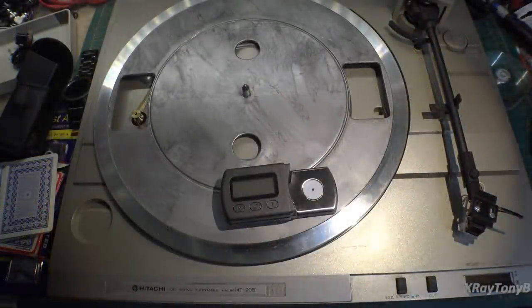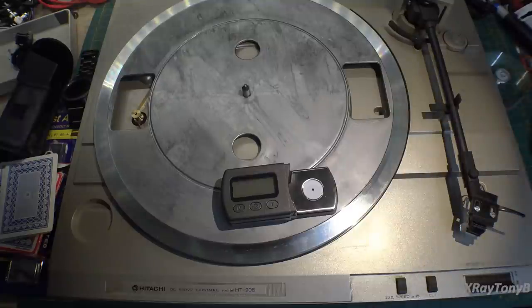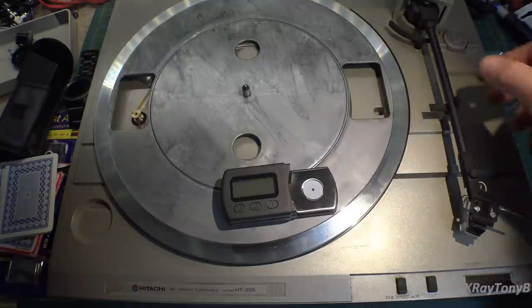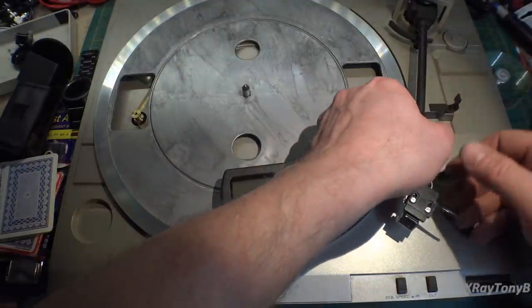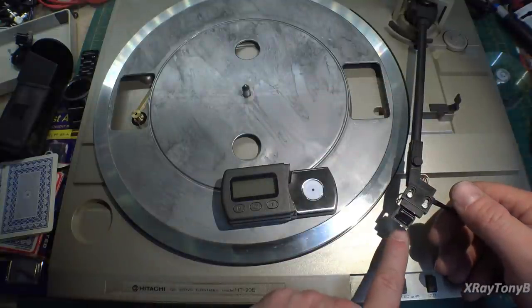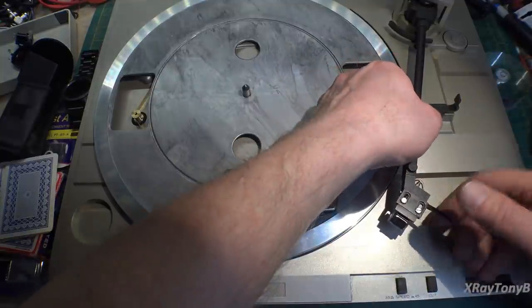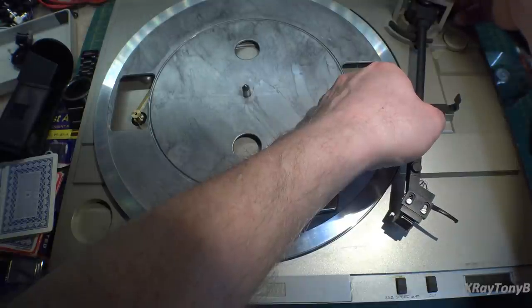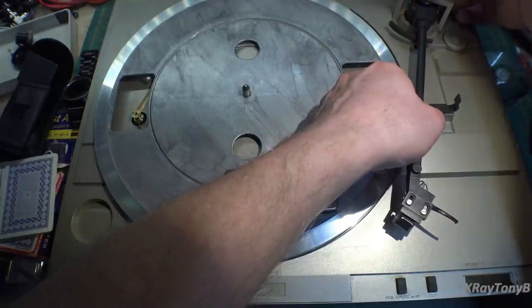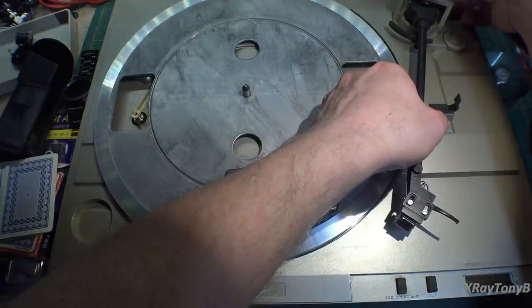For the first part of the alignment, we want to first set our tracking weight. We can always come back after that and do everything else, but we've got to set the tracking weight first. So what I like to do is I'll take this off first of all. And if you have a stylus guard, it's good to leave it down just in case. And I'm going to take this all the way in, and I'm going to start bringing it out